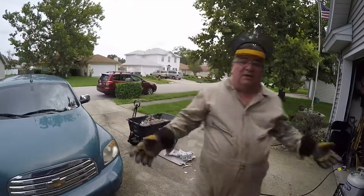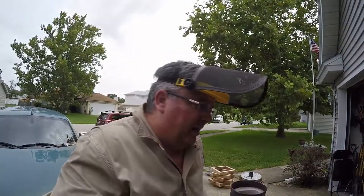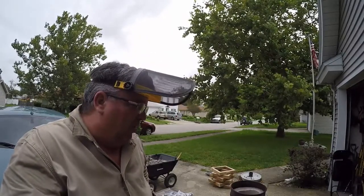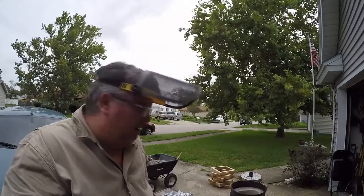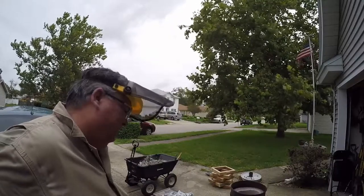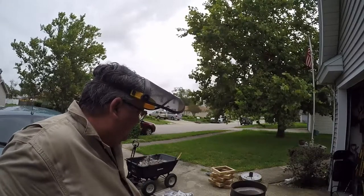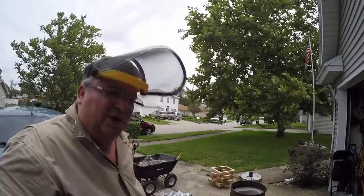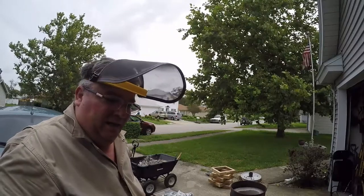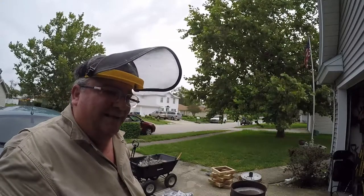Okay. Another successful pour. I'm always too darn impatient when I'm melting the metal, but it finally got there and I poured it before it got too hot. Unfortunately, it just didn't have enough metal. Now, if I had a number 70 crucible like we used to have in the foundry in the ships, I'd have had plenty, and I would have had to pig off the rest. Pigged off is just another phrase meaning pouring the excess into a pig iron mold.